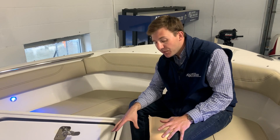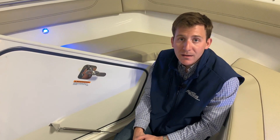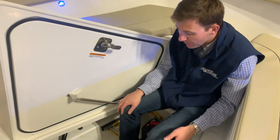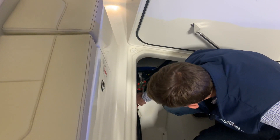In front of the console, in this floor compartment — this is your bow area underneath the deck. Right here is your holding tank. Right here is your bow thruster battery right under my legs. Your bow thruster is running off a battery, so that's why it's important to have the house charger when you have it — so when you plug your boat in at the dock, you turn that on and you can charge your batteries. The battery is the most important part.